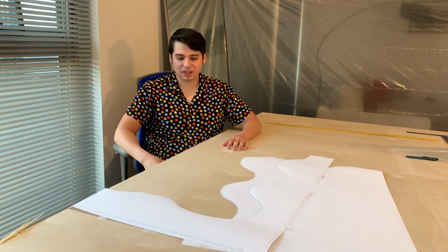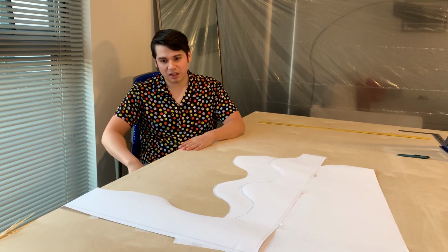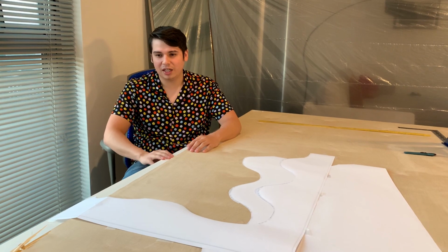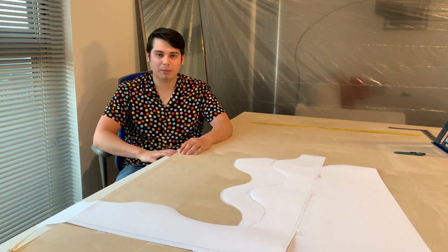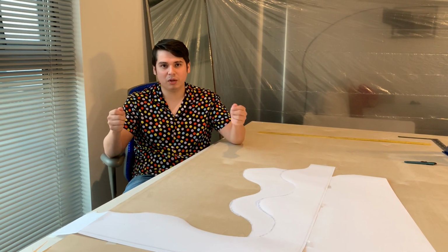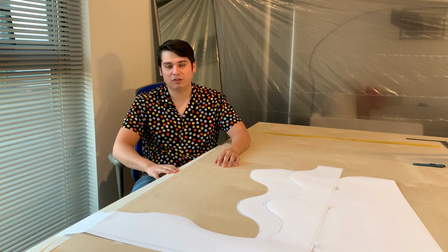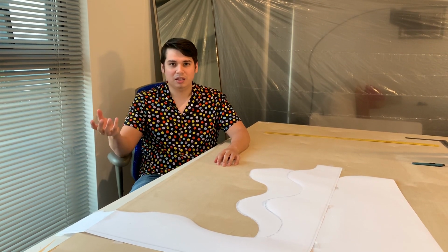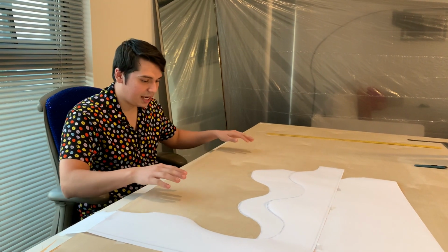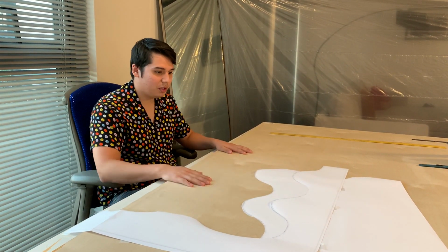So what we're using here is 3/4 inch birch. We chose this because it's a light color, and what we have in the bottom here is something very glossy. I don't remember what the name of it was, but we'll be using it for the back, and I'll reference that later. The reason that we're not creating the main front panel of our mirror out of this bottom nice glossy side is because we don't want to have to struggle with trying to get the paint to adhere to our material, right? So we actually got this at Menards, and we rented a truck because we don't own a truck, and we were able to get it down here.